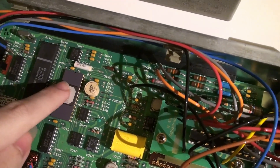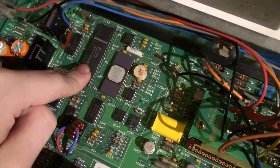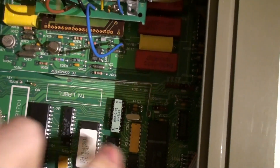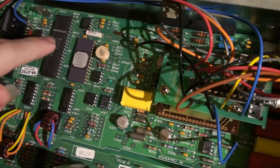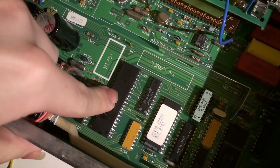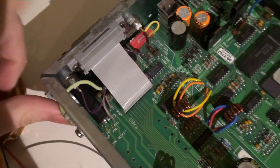There's a small oscillator up here in the corner which will impose a bit of noise. There are what appear to be two processors — one on each side — but looking at the part numbers, B8718 and B8724, they're actually different chips. I think this larger chip here is the calibration storage area — it looks like a read-protected RAM of some kind.